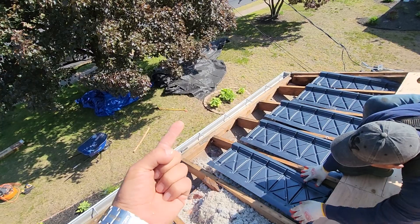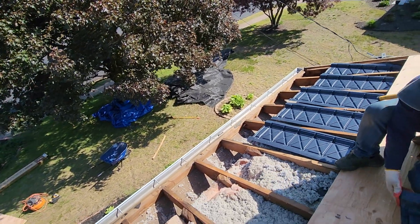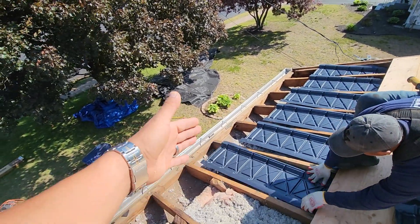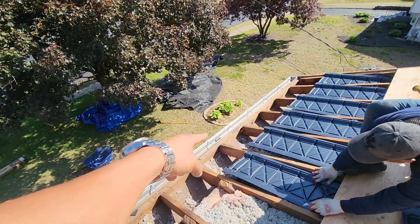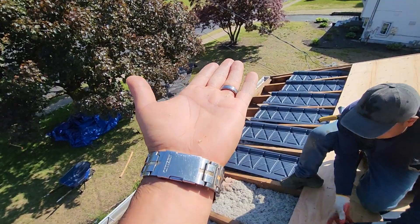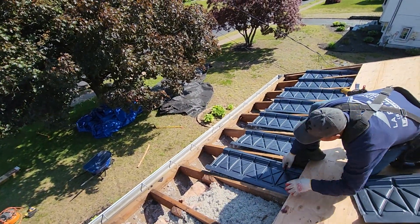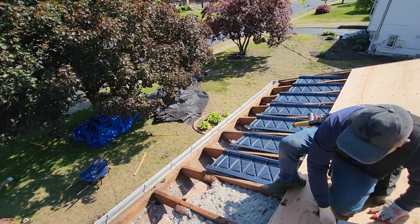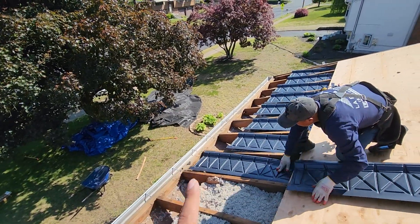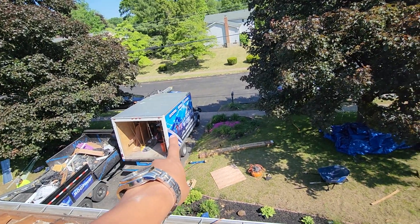The air is gonna come in through the soffit, the overhang of your roof. So if your contractor is not doing this, you don't have proper ventilation — he's just putting in a nice vented soffit at the eaves, but the insulation is blocking against the plywood. The job is not done properly if the insulation is blocking. If you want it done the right way, call LA Roofing.